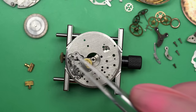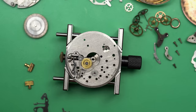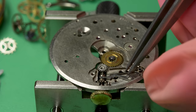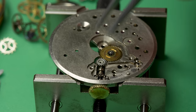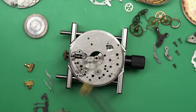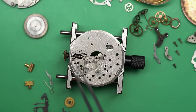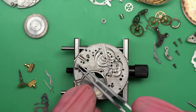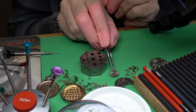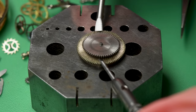Here's the keyless and motion works — I can take those both out, and they look exactly the same. This is a fully dedicated chronograph, meaning this movement was designed to be a chronograph — there is no regular version of this movement that isn't a chronograph. Some modern ones aren't like that; there are companies that make modules you can put on commonly used movements to add functionality like GMT, 24-hour, or even a chronograph.